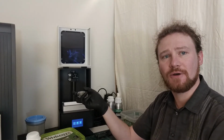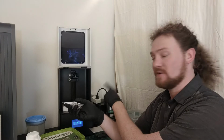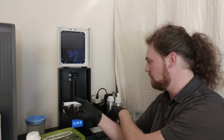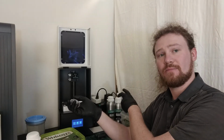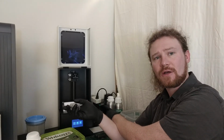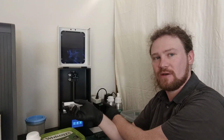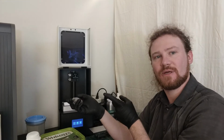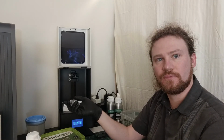During printing, it was at about 100, which I think is because there is no air circulating within the build chamber when the part is printing. There's only fans, probably cooling fans on both the ultraviolet LED in the bottom and the power converter on the side, the LED power driver. Those are pretty high airflow, pretty loud fans, so I suspect it is kicking up dust in my apartment. I don't think the PM 2.5 measurement is affected by volatile organics or anything like that. I think it was just getting kicked up.